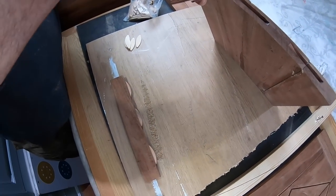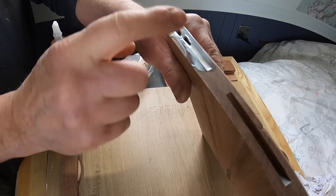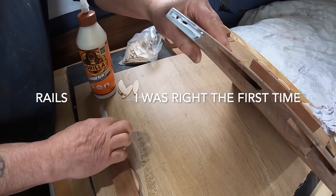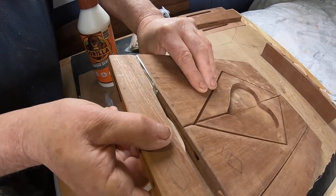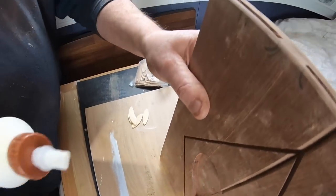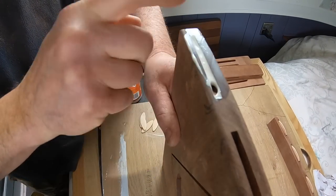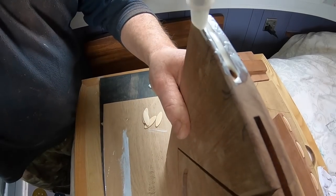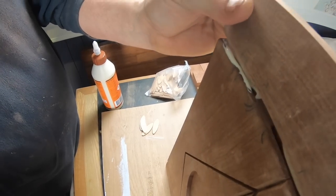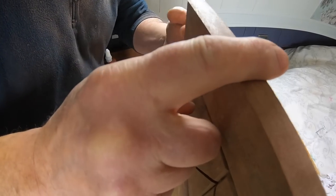Once they were dry, we could then do the rails that go across. What are they called on a door? I don't know. I've forgotten what they are. I'll put it in the description in a minute. We've only glued one side, and that bit is going to be the area that we screw to the main hatch. It stays rigid, but everything else should be able to slide along. We've made the biscuit holes a bit bigger so it can all give along. That bit of movement to it.